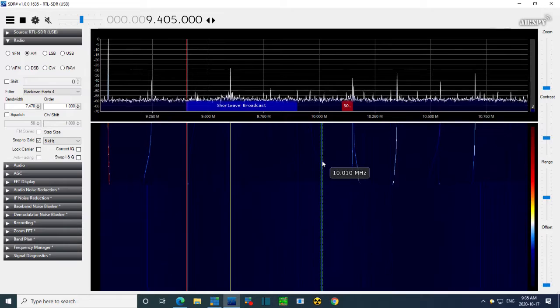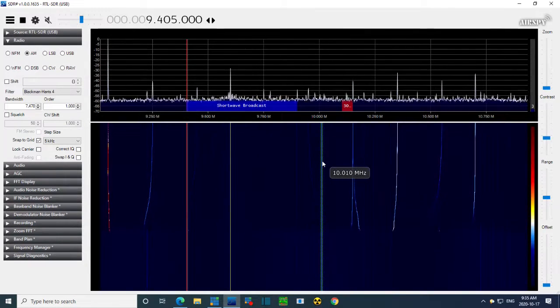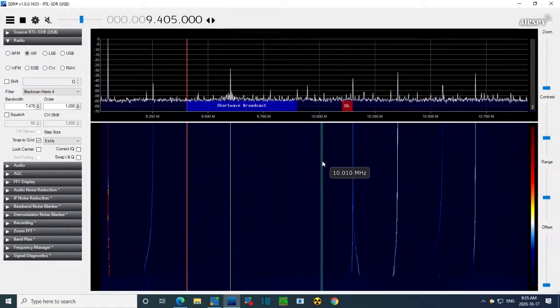So that was pretty interesting. I wasn't touching anything. The radio came to life, and for that moment you could hear it come out of the speaker, that little hissy sound, just for a few seconds. And then it seemed to fade right down. That's pretty curious. Now you can see all the signals that appear here. One of those is supposedly the local oscillator, but there's nothing really right around the area I'm expecting it to be. And ignoring that 9600 signal.